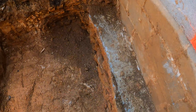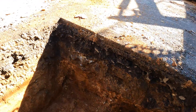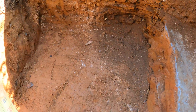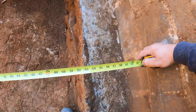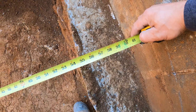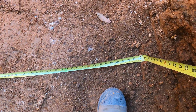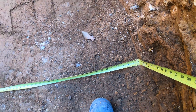You can see this is the existing footer — that's what we're tying into. We went down to a depth of 36 inches, and we need to be at least five feet out from the front of the wall. You can see we're like the tape measure plus about 66 inches. Our width needs to be at least six feet wide and we're about six foot four wide.